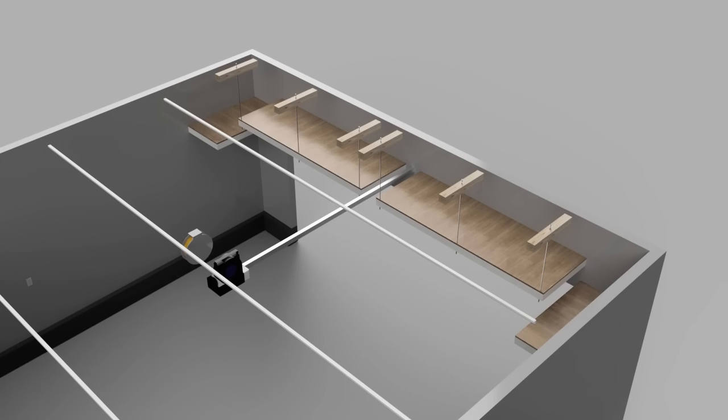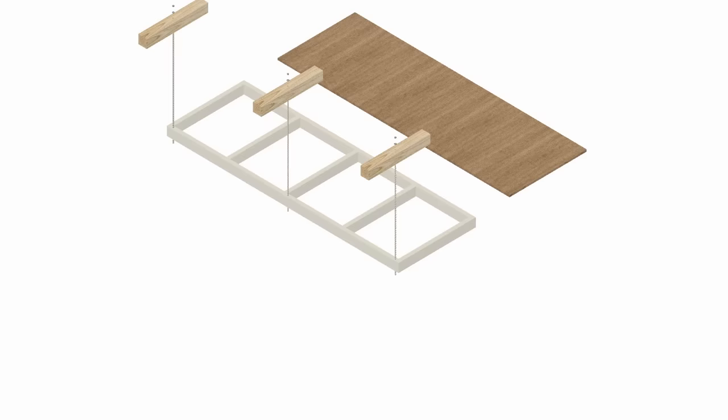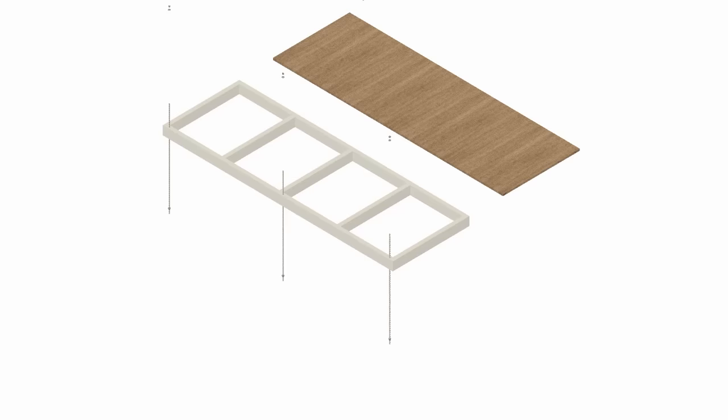All right, so here's the CAD drawing and you can see that there's a total of four shelves. We have two over top of the garage and two on either side, and they're connected into the attic by threaded rod to 4x4s. Here's an animation showing how each of the parts interact with each other and kind of assemble. You can see the threaded rods, the 4x4s, 2x4s, and the sheets of plywood that I'm going to be making these out of.